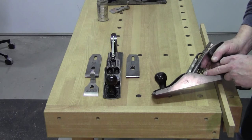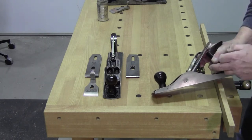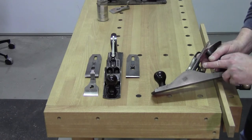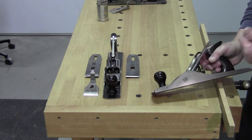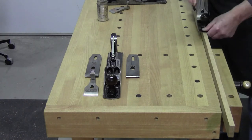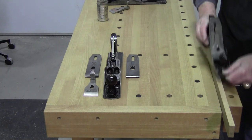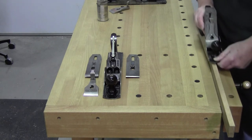advancing knob. Now the advancing knob, if it's all the way back into the retract position, has, as you can see, a little bit of play. So you need to bring it forward to the advanced position and leave it there. Never retract a blade and leave it in retract position. Always advance and leave it in advance. It holds everything together better. So what we're going to do is with this finger, I'm making minute adjustments to the blade advance while I'm bringing it forward.